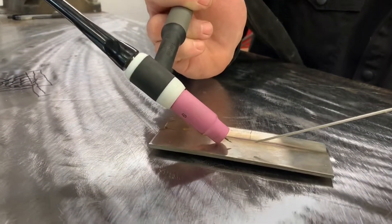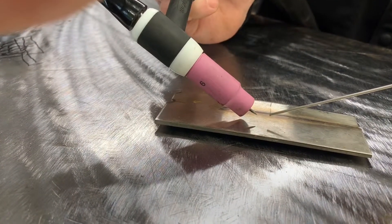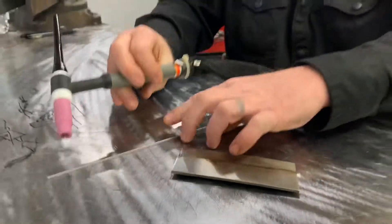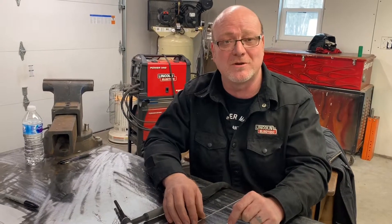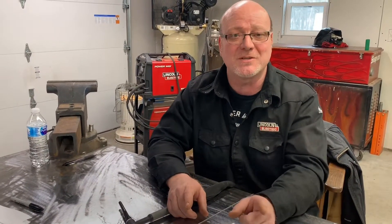You're driving that arc into the base metal. As soon as you start turning this thing over, that arc starts deflecting, and your tungsten starts balling up on the end and melting away from you. It's as simple as that — torch angles, head position, being comfortable, and having good sight lines. Work on being able to see that arc better and stop laying that torch over. Try it out — I'll bet it works. Follow me on Instagram, Mark Presser Welds, and go get a copy of Arc Magazine for the column. Thanks for watching.